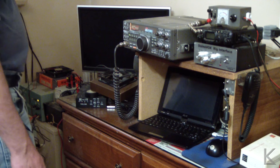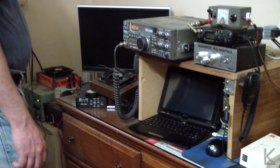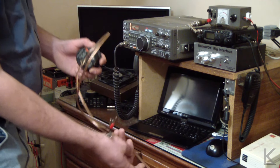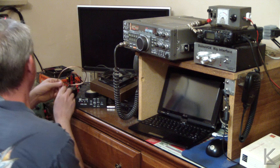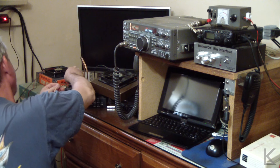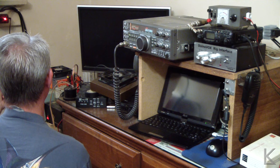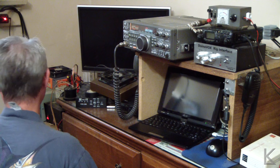Over here on the wall I've got a power brick that is the Baofeng charger — nope, that's not it. It's really starting to look like it's the power supply, although I've never heard that kind of a whine coming from a linear power supply before. I got a set of clip leads and I'm going to clip onto the Astron supply and feed the radio with that one. It's not the power supply. This is a mystery, isn't it?